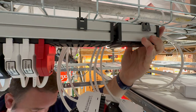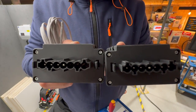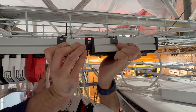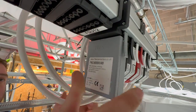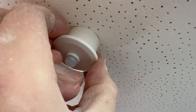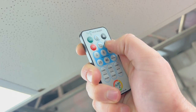Instead of using the expansion module that shares all of the electrical connections with the starter pack, we'll use a tap-off unit. This looks similar to the expansion module but doesn't have a through connection on the DALI or the switched live from the previous module. We re-plug our lights back into the new tap-off box, add a new control module and an additional PIR. Faster than the time it takes to boot up a Windows laptop, we've completely reconfigured our control system to serve two separate rooms. We can make fine adjustments to the control system with the remote control.